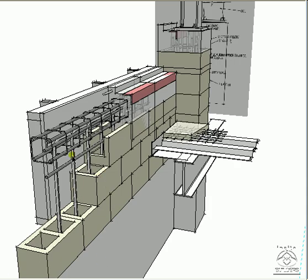This is that same detail except the reinforcing has been beefed up on the top of the wall to take the loads expected from the precast panels above. This is the formwork on one side of the masonry wall — the other would be put on at the last minute. This is the vertical steel coming out of the masonry wall, bent to tie into this bundle of rebar that goes through the top of the concrete beam. Note again this bond beam — this is the open masonry unit. The bottom is open so that concrete or grout goes down into these cells and down into the wall, meaning this wall is tied with this beam that runs continuously between pilaster and pilaster, tying the pilasters and walls together.